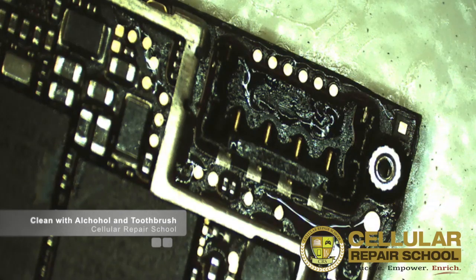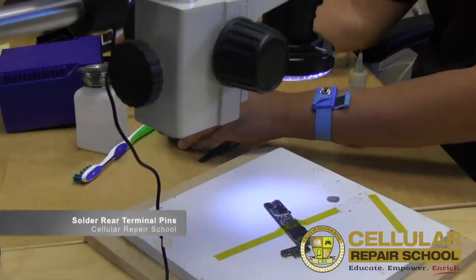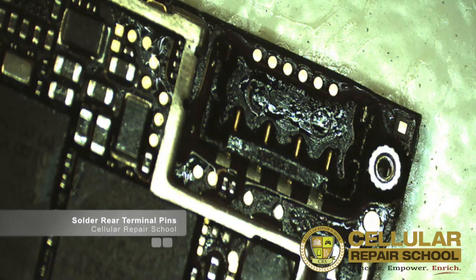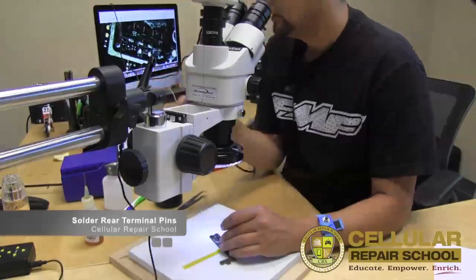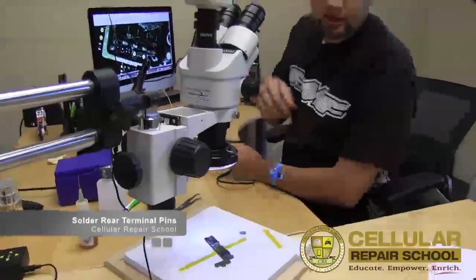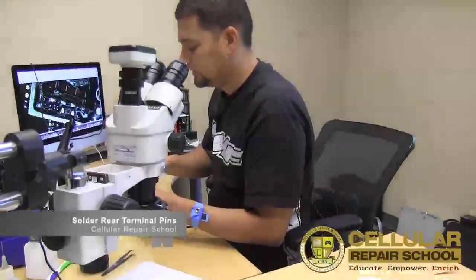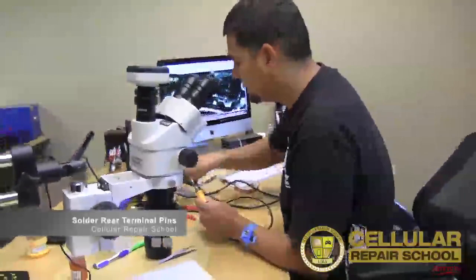Let's move on to the next step. I'm going to solder the four contact pads in the back. I'm going to add a little bit of flux on each pad — we always add flux every time we solder because it prevents oxidation and gives us proper wetting. Let me zoom in to get a better look. I'm going to change my tip; it looks like it's a little bit too big. The problem with using a smaller tip is it doesn't transfer heat as well, so it's harder to work with, but in some cases you have no choice.